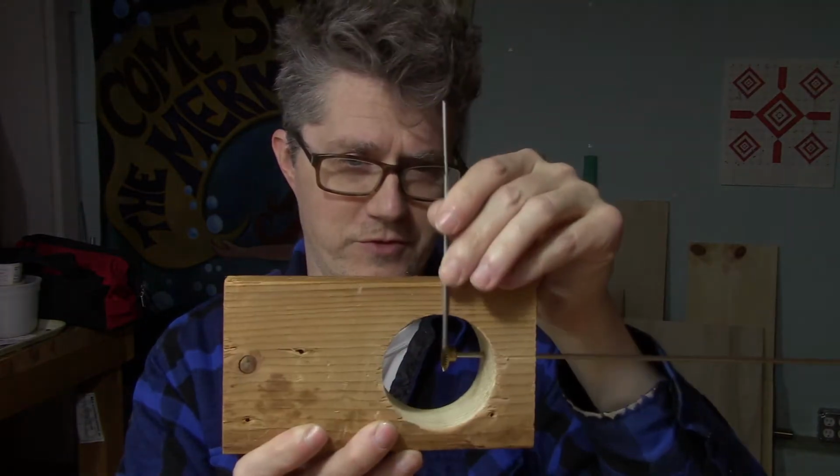Sometimes stuff goes easily, and sometimes it doesn't. I didn't have the stainless steel tubing that I wanted for the vertical shaft in this machine, so I had to order it. And much to my surprise, there really were almost no options in the place where I ordered this stuff. So I got this piece of tubing, which the interior diameter is 3/1000ths of an inch smaller than what I wanted. I didn't think it would matter. Turns out it matters. I can drill it out, it's okay, but it's just another step to have to take.